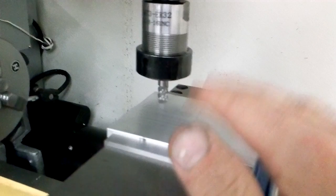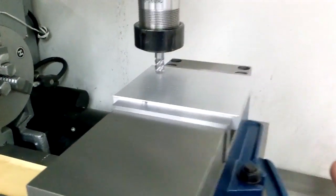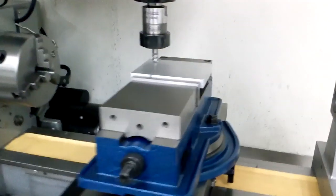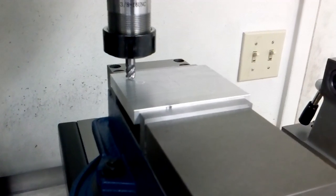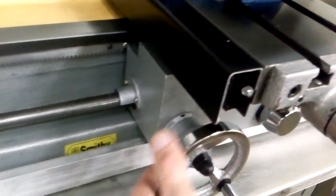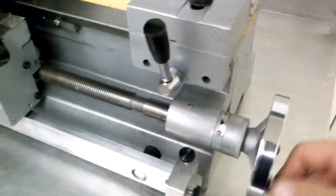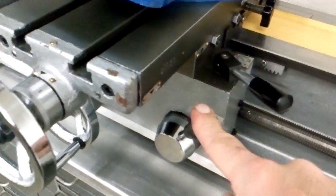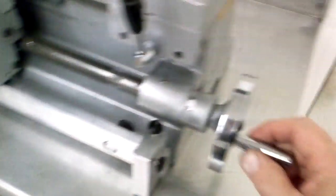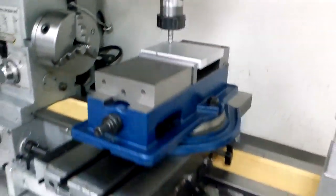I have a piece of half-inch aluminum viced up here, and one of the operations I do a lot is cutting a pocket out of it. Doing it the normal way — running the piece leaving maybe three thousandths of an inch left to cut, then coming back for your cleanup pass — what was happening, especially when I was down milling, every time I came to do that cleanup pass and got to my corner, I would overshoot the corner using the hand controllers. You can use the longitude lockout, but there's still a lot of backlash in the gearing you really can't do anything about. You're actually better off using the threading one, but that's still at about five thousandths of an inch backlash — and when you're trying to do something accurate into a corner, five thousandths is a lot and ruins the piece almost every time.